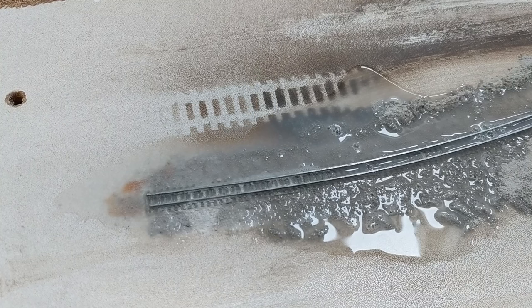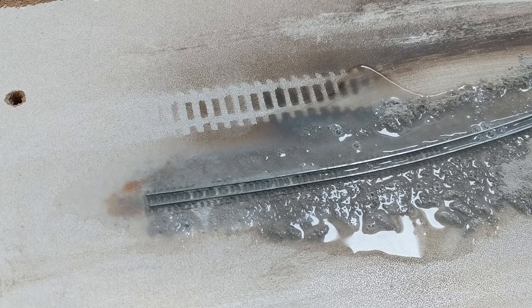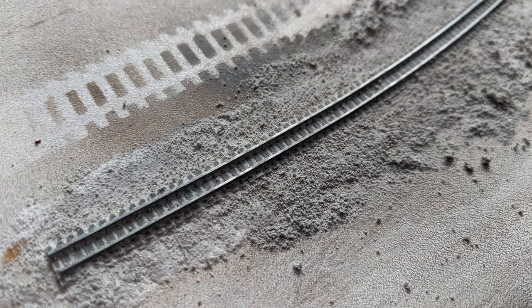Most of the bits in these pictures are debris from the dry islands that I ran my fingers over to see if they'd stuck down. I added some water and PVA mix to an area of grout that had previously been wet with just water and then dried, the idea being to add a seal over it to make it stronger and lock its texture in. I didn't do that on camera, but I could see the mix being absorbed into the grout and caught the end of it on camera. Ultimately, once dry, it didn't look different and wasn't much stronger.